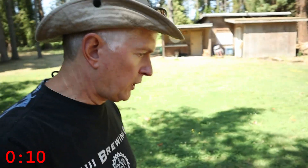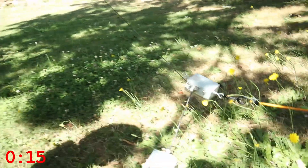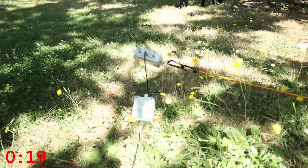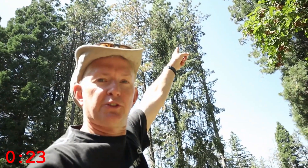I've got my 49-to-1 balun here. We've seen many times before, minus the dog — and a 1-to-1 choke. It is draped over that highest tree up there, which is at about 110 to 115 feet. So today I want to tune that wire for 160 meters.